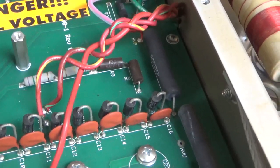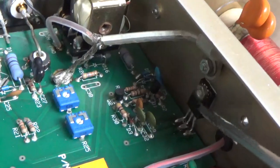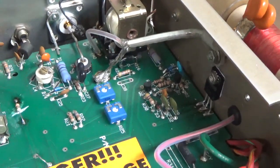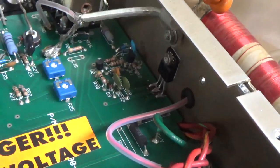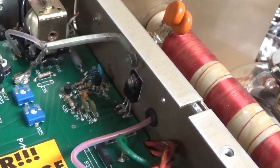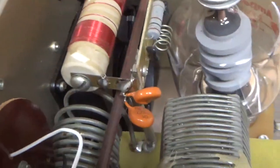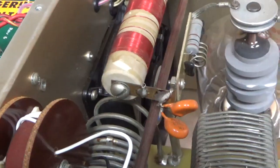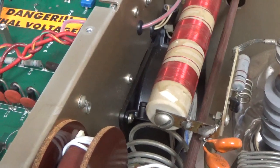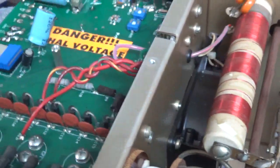So if you need an amp repair, feel free to give me a call. Phone number is 203-892-4119. Websites are AmpRepairGuy.com and also HarbachElectronics.com. Almost forgot — I also replaced the transistor for the dynamic bias circuit. A brand new one. I always put just a thin layer of thermal grease on the back of it, then crank it nice and tight up against the wall — just enough to cover the surface so you can't see the back of the transistor anymore. All right, thank you for watching. Please like, share, and subscribe. I'd really appreciate it. Have a great day and great night — I've been working on this all day, started at 5:15 AM and it's now 4:21 PM with about a 15-minute lunch. Now it's dinner time. Thank you for watching. 73.